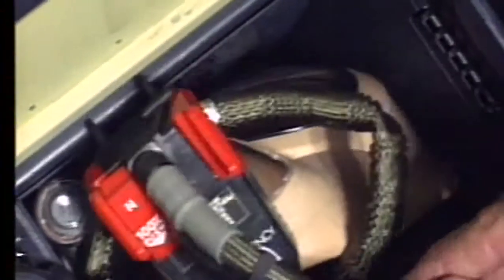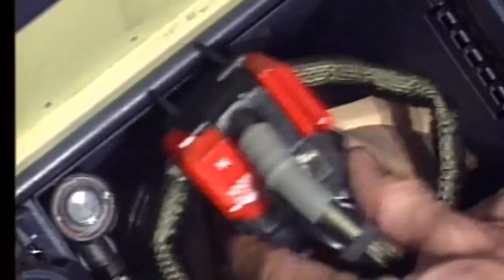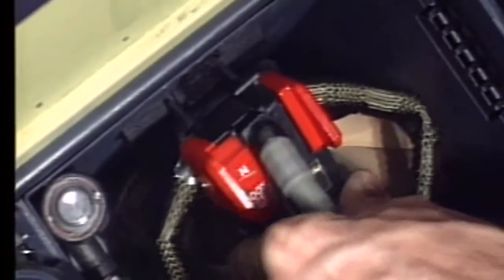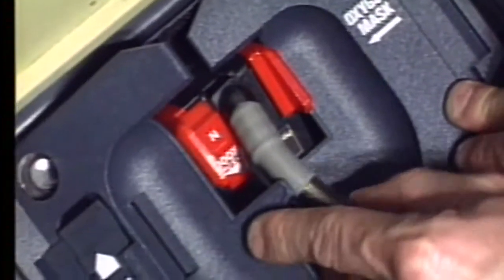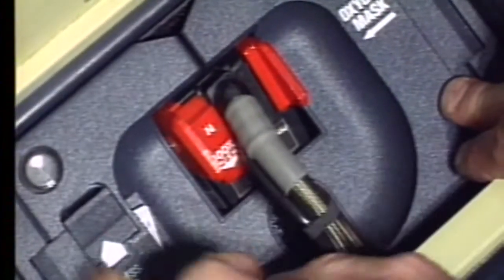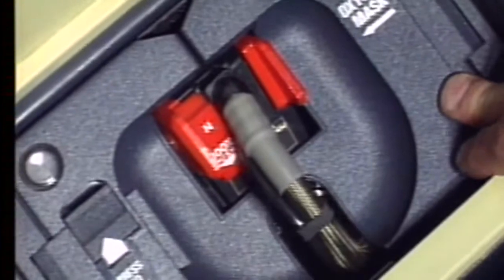Engage the mask assembly regulator on top. Close the left flap door carefully while pushing the reset test slider to retract the oxy-on flag. At the end of the re-stowing operation, do the in-situ testing.